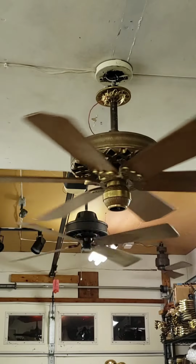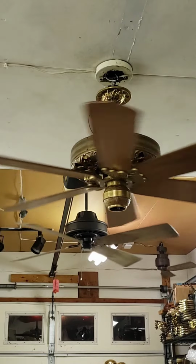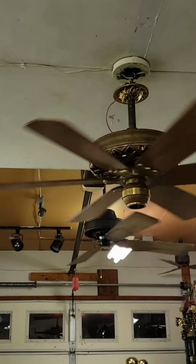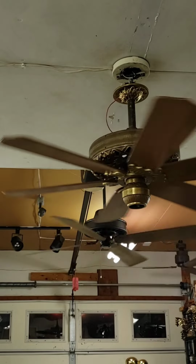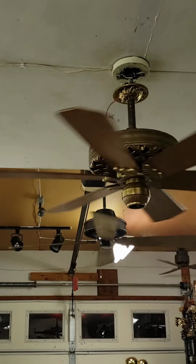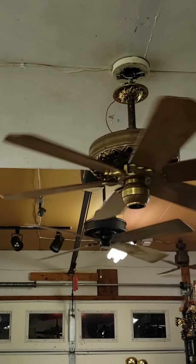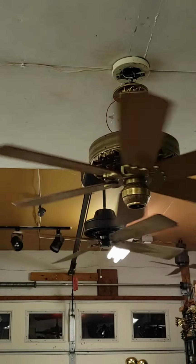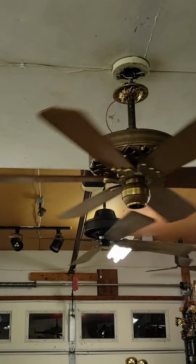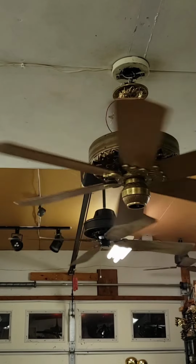So this is ideal. Can you see both fans over there? Now you can. But there's a couple problems with it. One is the low speed isn't working, and even though that wouldn't be necessary if it was smart control, it still bothers me. I want to figure out why it wasn't working, because it was working the last time we tested this with 5 blades. 2, it's noisy, and not solid state noise, just noisy, and I can probably solve that one. So that's not the end of the world, but it is a thing.